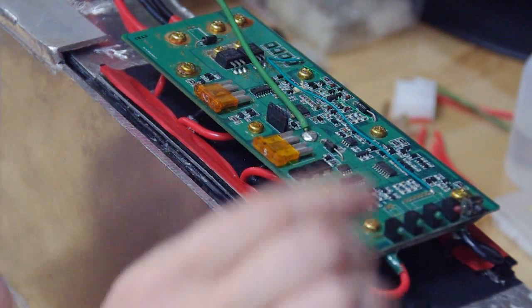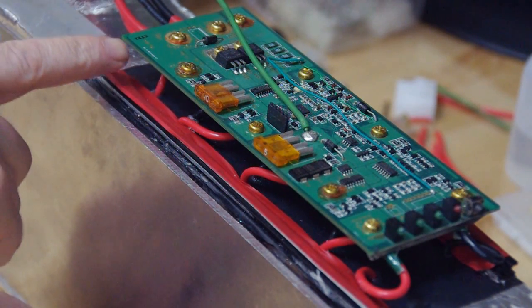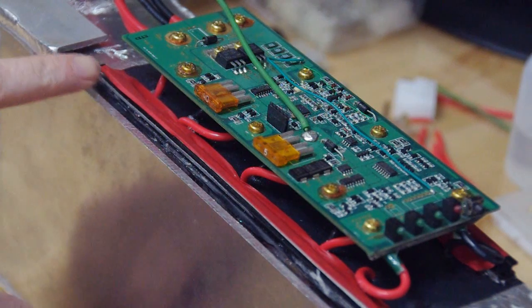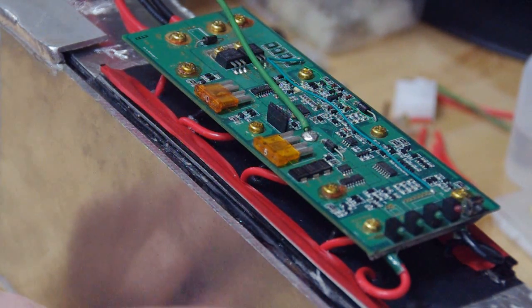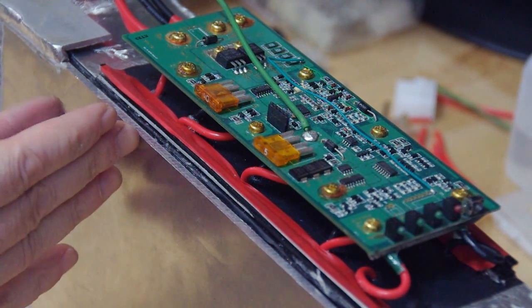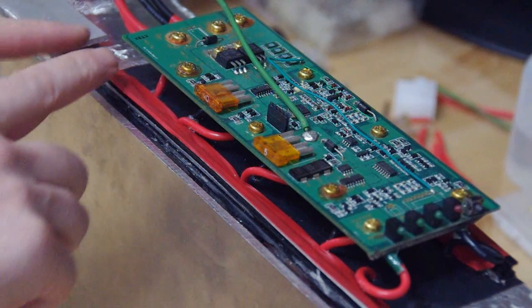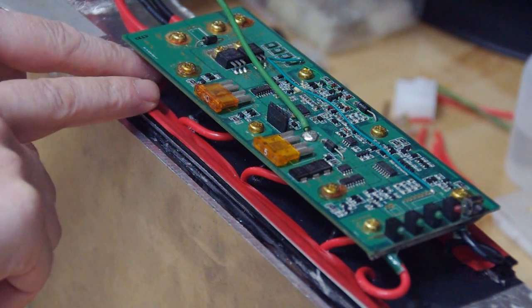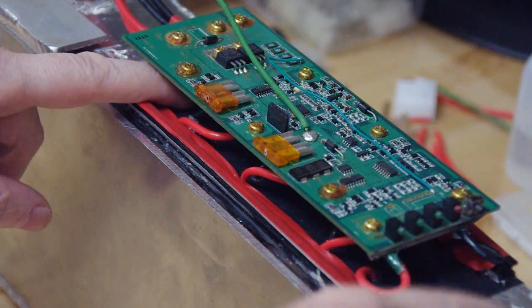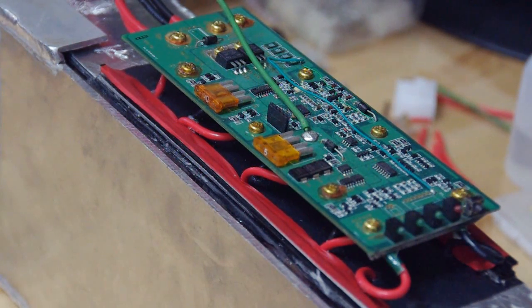So when you cut, the cables came out about this long, and I always made sure that minus, plus, minus, plus, minus, plus, from the left to the right, they came in the order as they are in here. So whichever is to the left, and then to the right, and then to the left, and to the right is always the next unit, so I always know which is which. That's not very convenient for putting the cables to the board, so what you have to do is lay the cable in circles onto the case, and duct tape them and cut them exactly so they end up above the hole where you want them to be.